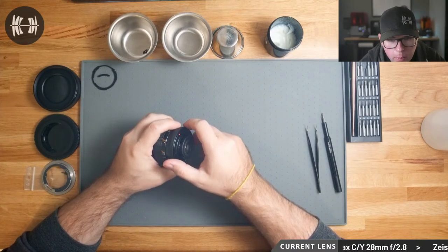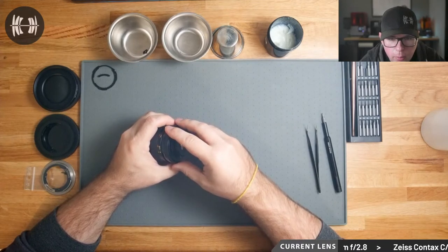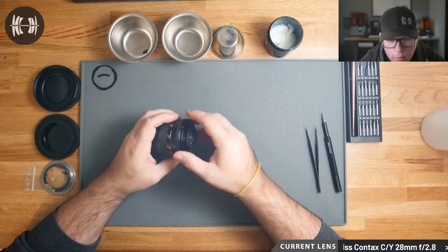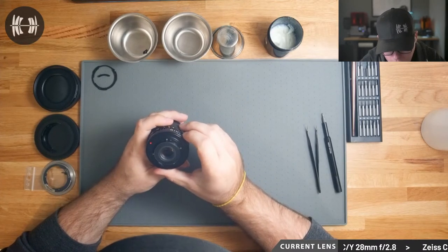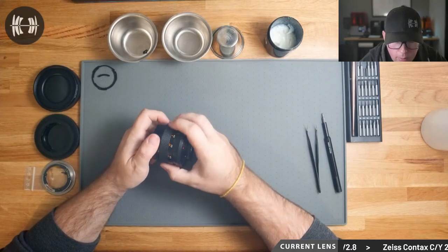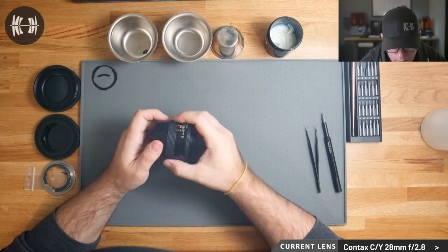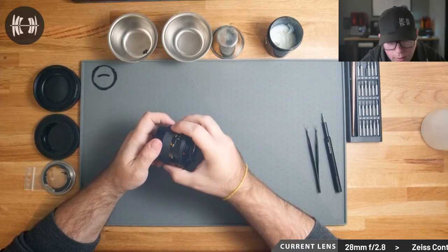I did click and dampened. You mean damped? My Leica R 28mm with the iris closes by itself. Probably at the 50. Do I need to take? No, you cannot take the spring out, or it won't work. And you cannot use a more viscous grease because that means it'll just close slower. There are tricks of the trade. There are techniques that I can't really recommend people do unless they are a little more experienced, because it could ruin the lens.